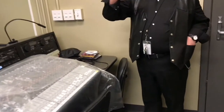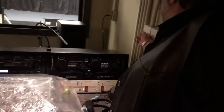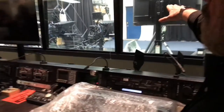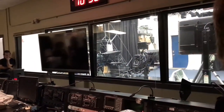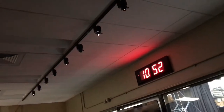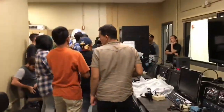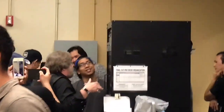Turn on the lights — it takes a minute for your eyes to adjust. Now, these are work lights, meaning this is for setup. Once you've got everything plugged in, turned on, and all your engineering is working, you really don't want to use those. You want to use these — they're very expensive and they're set up this way on purpose so there's no glare on the windows. The windows are also indented to cut out glare from the studio so you can see out there. Once you get it set up, turn those lights all the way down until you hear them click. If you don't hear them click, they're still on — you always want to hear that click, and then it's off.